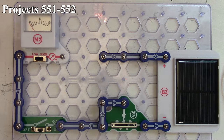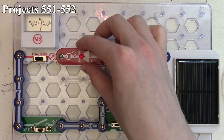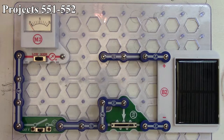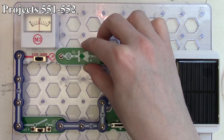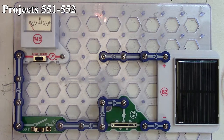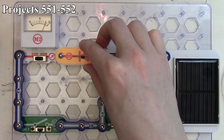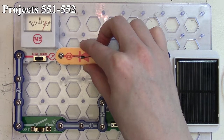For project 552, we take diodes one, two, and three and put them in line to see how they behave. Diode one — the red LED — is lighting up a little and shows about six on the meter. Diode two — the green LED — is much more faint, showing just shy of five on the meter, so there's a little less current through the green LED than the red. Diode three is a regular diode, not a light-emitting diode — it shows about eight on the meter because there's not as large a voltage drop across it as with the light-emitting diodes.